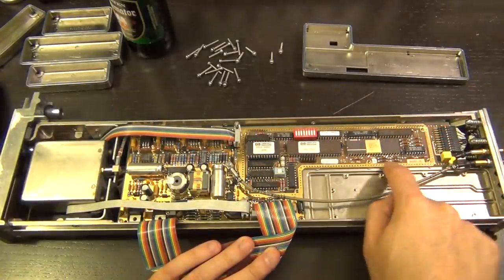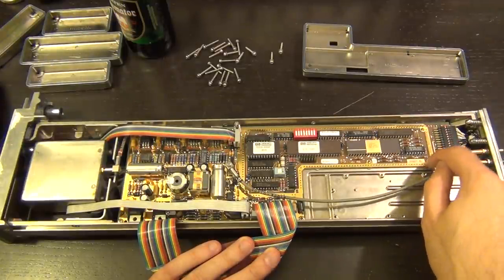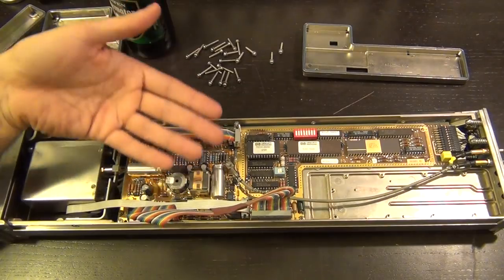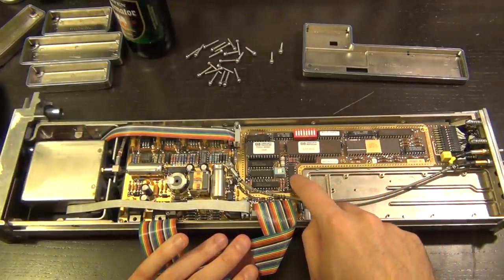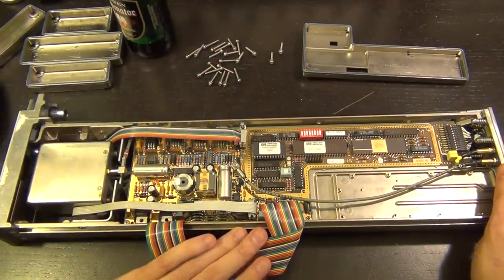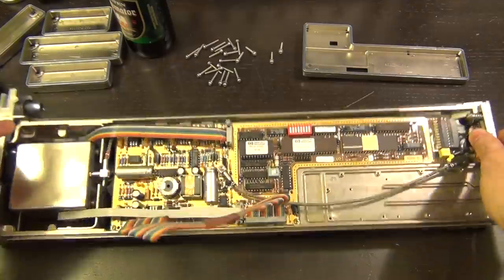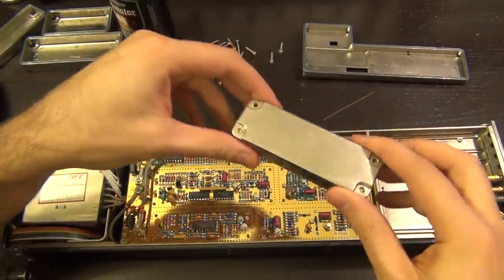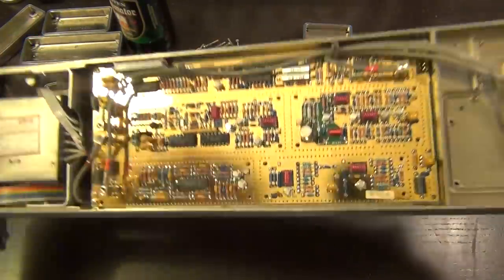It's cool to note that the RF ground ends in the middle — this thing has a completely isolated digital ground. The shield stitching goes through the PCB but does not go underneath the digital ICs, whereas the RF area has the copper poured and fully exposed — gold plated, possibly. The shielding is very well done, and the board has no silkscreen — it's completely exposed, very shiny and pretty.